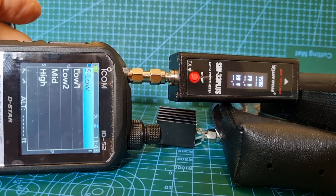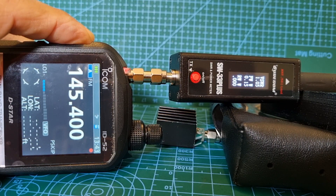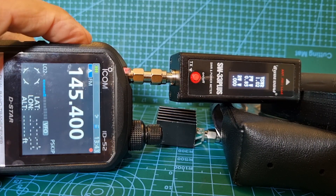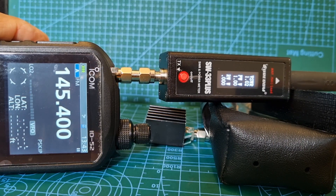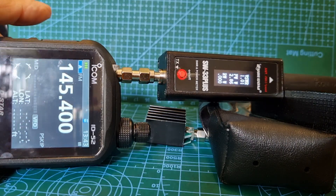So that's okay, let's go up to low two - it's probably about one watt, I'll look it up later. Yeah, there it is: 0.15. Good SWR. Let's go up to the next one - low: one watt. And again mid: nearly three watts. We've done five. Let's just put the dummy load on there.